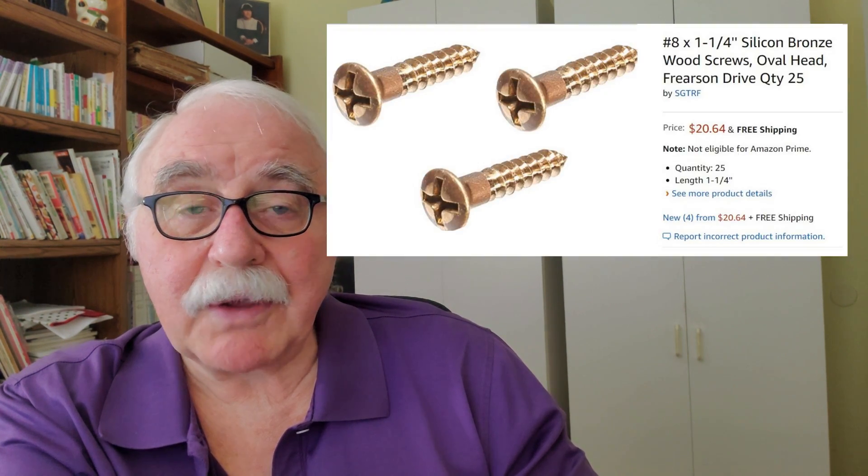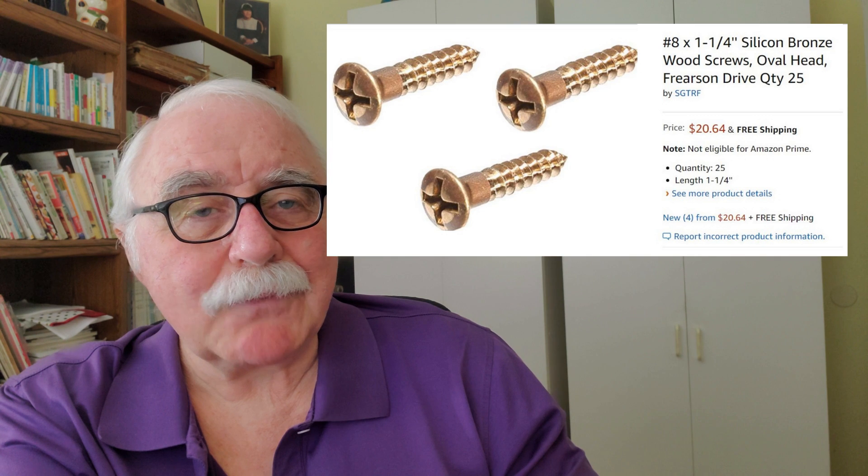That's why I usually recommend a different kind of fastener than many other boats, and even different materials. You need to consider that when you're selecting a boat — what kind of fasteners you need and how much they cost. If you were to build a seagoing basically wooden hull design, you would probably want to use bronze fasteners because they're the best ones in the ocean. But in my hulls you can get by with other materials.